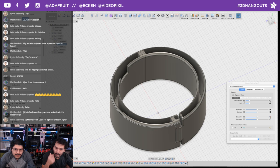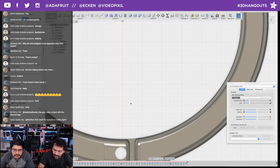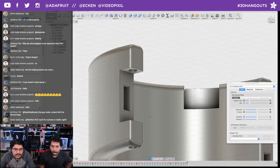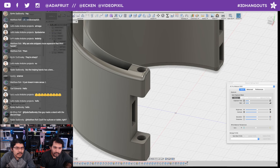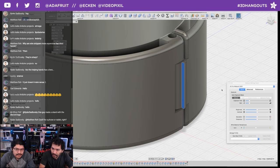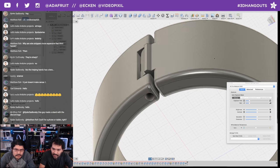There's a cool tip for the hinge area. No supports were needed for the overhangs, but you can optimize further using drafts. The hinge has an end stopper — a little piece of geometry that limits opening so it doesn't bend or kink the wires passing through. Nice little design touch.